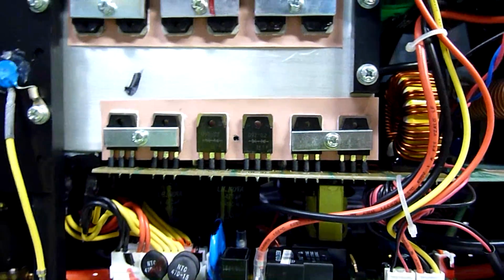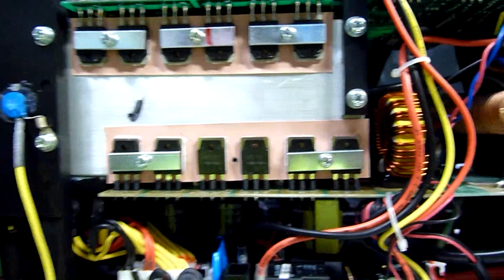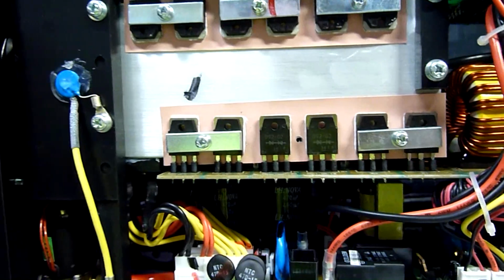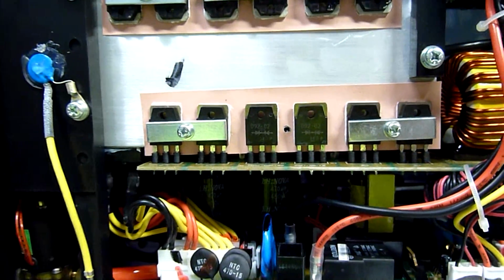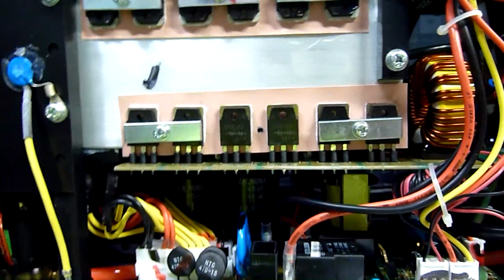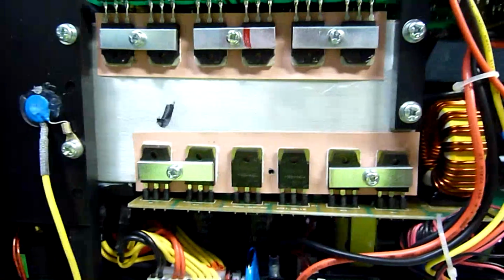They don't have a lot of compound on them, and these are usually the ones that I see burned up or blown out on the dead welders that I've seen in the scrap bins. Usually it's pretty catastrophic failure. There's a lot of burning going on inside when they do go. You have to wonder if the things are properly protected or grounded even to begin with, because it should trip out before fire starts, but I've seen a couple that have caught fire.